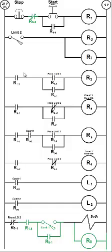So now, as soon as it starts to retract, this becomes open. Why? Because look, that closed, that energized, and that became open. So now when this becomes open, this de-energizes and this closes. Right? It goes back to its normal state. So it is now recording the event of it being done, or specifically it's recording the done event. So the event is that the cylinder went out. When it leaves, that event's done, and it records that. So it counts 1. Okay, let's continue.